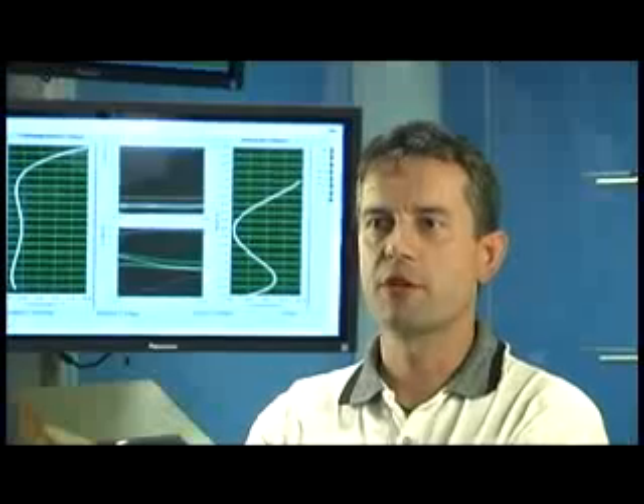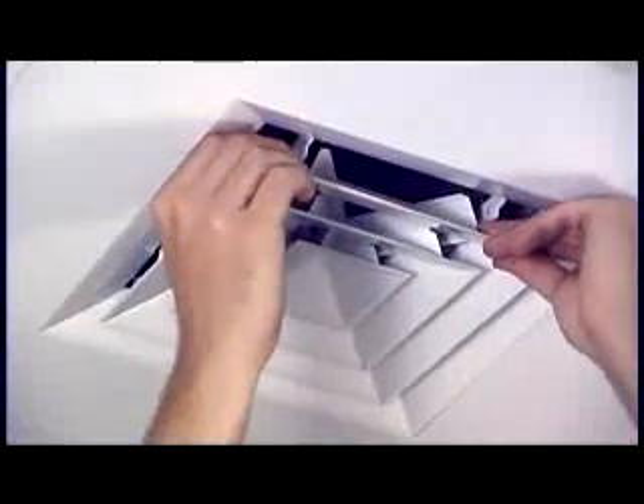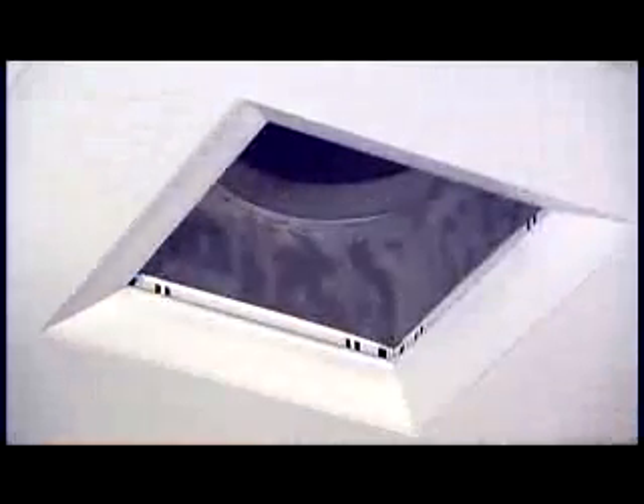The Price SMX AMX Louvered High Induction Directional Diffusers are offered in steel and aluminum and feature all-welded construction. The discharge vanes clip over the louvers and are securely welded in place to minimize noise and the possibility of rattling in the airstream. The core is easily removable from the front without the use of any tools. Each diffuser is painted with highly durable powder paint that resists scratching, chipping, and has very good resistance to cleaning agents.